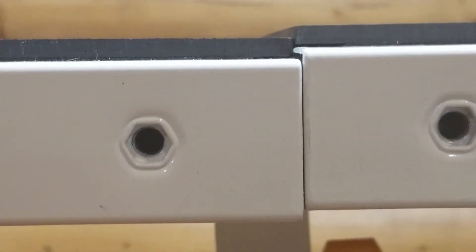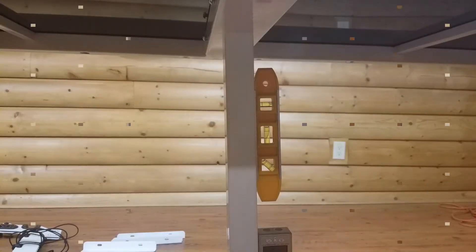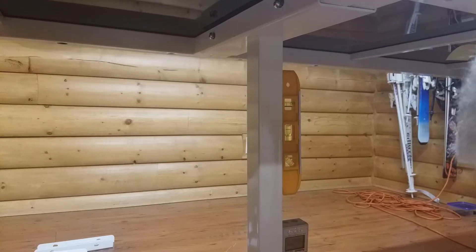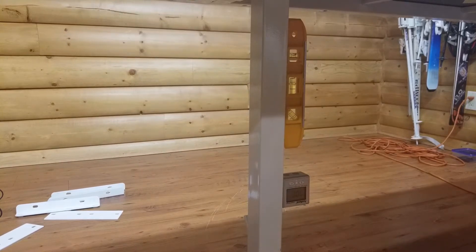You can see how the right section is much higher than the left section at the top of the leg. By aligning this, we'll get it much closer and hopefully perfect. I'm going to gently tap the leg until it gets to zero. Now we're at zero, the bubble is in the center, and we're sitting much closer to level at the top joint. Still not perfect but good enough that we can snug it up and move on to the next step.